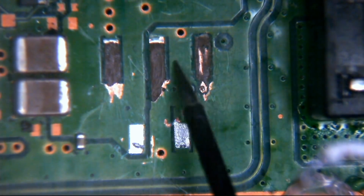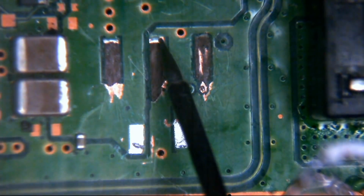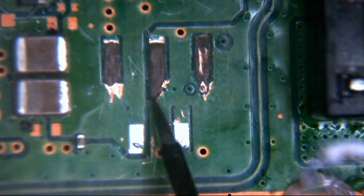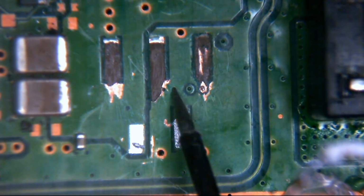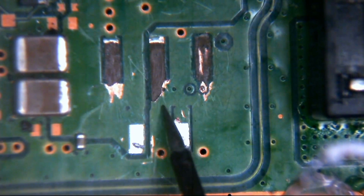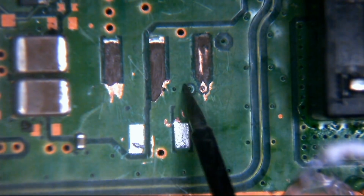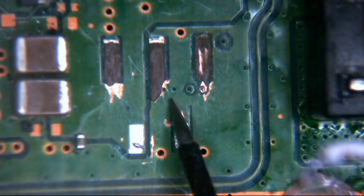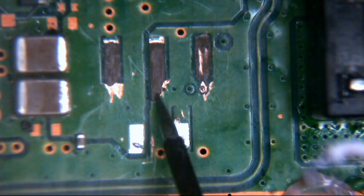So it comes out of this wide expansive area, comes down here and into the top of here. And also down here you might say, could there have been a via or something there? Or what's this bit here? But again, this is just a separation gap. That's not an issue. Maybe it's a partial via that goes down so many layers, but not all the way through, so they plug it and conformal coat over the top. So we're not too bothered about those.